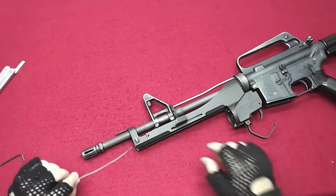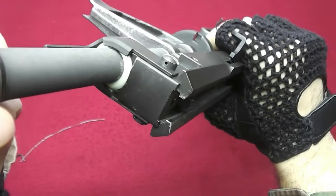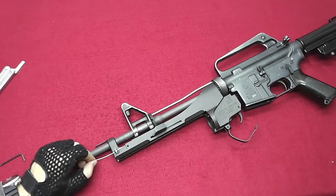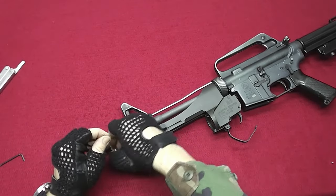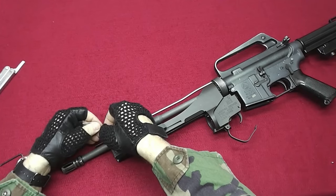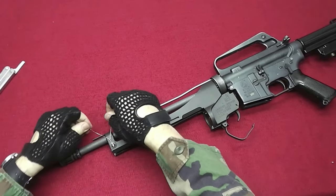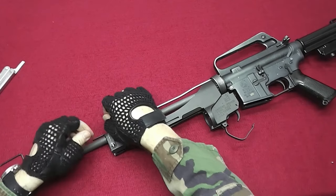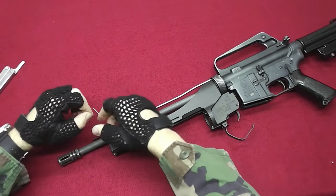First thing you do is insert the wire through this hole on the screw. Find the middle of the wire like that. Then twist — the twist should be tied around the screw, and the twist should be around an inch and a half, or about three centimeters long. The idea behind the twist is so it can get around to reach the other screw. We will do it a little bit more.